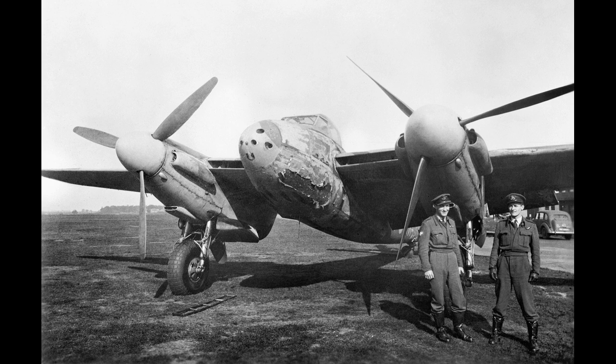This is what's called the feathered position, and it's the position you want the propeller in if you've lost the engine. A propeller that's not feathered will windmill and cause a huge amount of drag, so much so that in most cases the plane will not be able to hold altitude with the power from the remaining engine. Thus, if enemy fire knocks out an engine and the feathering pump, typically the remaining engine will only serve to carry the plane to the crash site.